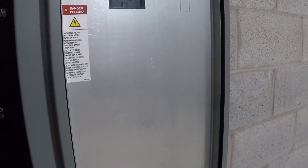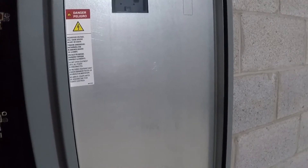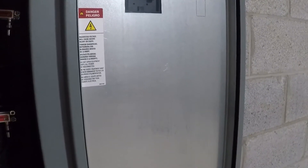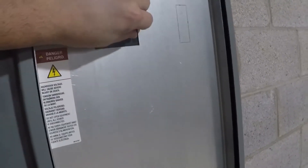When I do the simulation, it's probably not going to do a cooldown cycle because it's only going to run for a minute or two — it'll probably just go the standard three minutes and then turn off. This is also so that if linemen are working and the electricity is coming on and off repeatedly, it's not going to keep firing the generator on and off. It'll just wait until power has been on long enough that it's not going to go back out again.